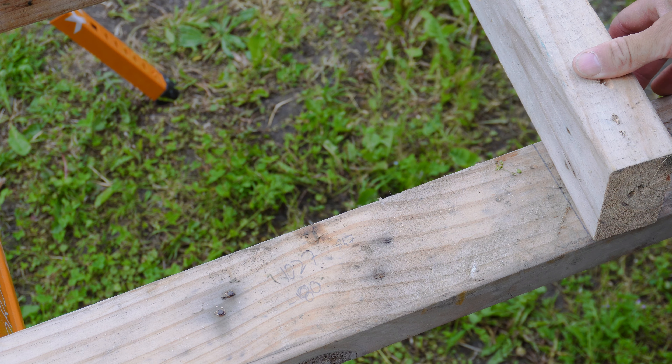Now let's get to the exciting stuff — rafter angles. That's why it's also called a rafter square. On your speed square you've got this protractor which has a series of angles on it. You've also got common cuts and hip and valley cuts, which is not something we tend to use in New Zealand — we tend to just use degrees. There are benefits to doing it both ways and I'll explain them shortly.